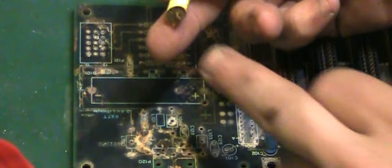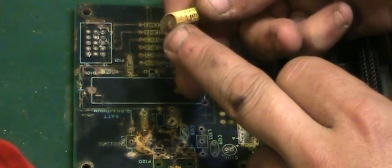Because we've not just got salt corrosion on here and the electrolyte, we've actually got ferric corrosion here, which is staining the board. This has come off the legs of that capacitor there, because that actually just broke off. It was that corroded. You can see it's just the metal in these legs corroding out, which has caused all this damage here.